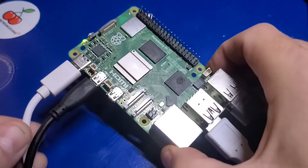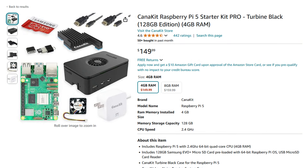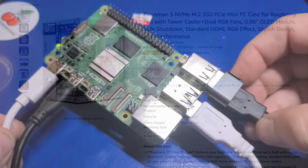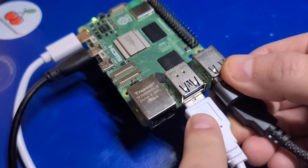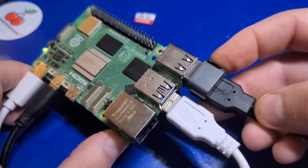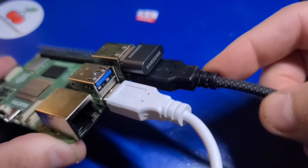I've connected a Raspberry Pi 5 to the control unit without a case so you can see all the connections easily. You'll want a cooling solution for the Pi 5 with a case. A few I recommend are the CanaKit cases — this particular kit includes everything including the Pi 5 and could easily be attached to the back of the control unit, maybe with some Velcro. Or if you want the Pi 5 to look like a mini desktop PC, the Pironman 5 case looks sharp and includes an excellent cooler, but no Pi 5 is included with the case. We have the USB-C power input, the micro HDMI, the full-size HDMI cable, the USB connection to the soundbar — and Batocera is configured to output through the soundbar. The USB stick has Batocera installed, but you can also use RecalBox or even RetroPie. This USB-A cable is connected to the USB Type-B cable on the back of the control unit — and that's all the connections.